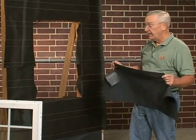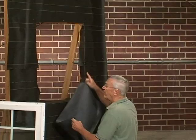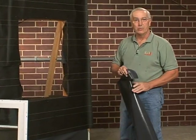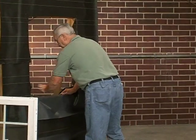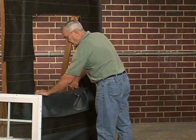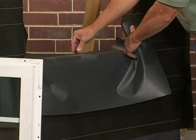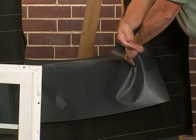I don't know if you'll take this extra step, but if you would, it would certainly add to your ability to keep water out of the home. What you could do, obviously after the window is in place, is come back and set this flashing against the house and pull it through the brick veneer. But it would be much better if, before the window was set, this piece could go into the base of the window into the rough opening just a bit and actually turn up on both sides, forming a dam. I've allowed this piece of flashing to be an inch or so long on both sides so that it turns up on both sides of the opening. Later it can also turn up in the back when the sheetrock is placed, forming a dam so that any water that gets in must then come back toward the exterior of the home.